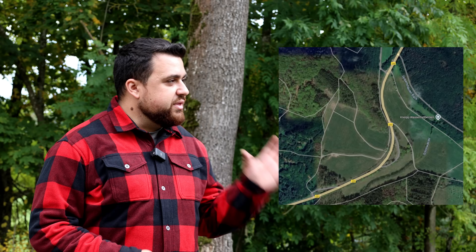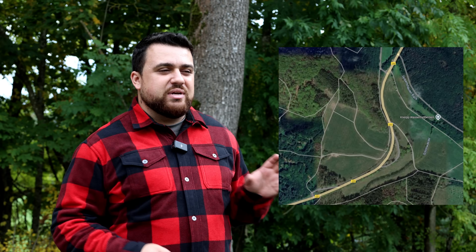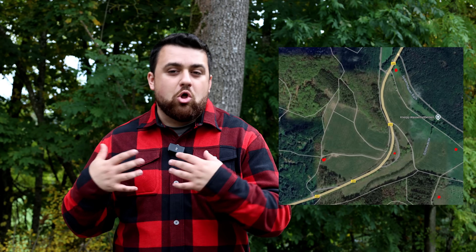So we're going to start by using this receiver as a rover. This is going to allow us to collect ground control points and checkpoints on site to ensure the accuracy and integrity of our data. This is an aerial view of the area that we're going to be flying our M400. The idea is that we're going to have five control points — one at the most extreme points that we can get to and then one in the center of the site. Having this control network along with RTK on our drone is going to ensure that we have the most accurate data.